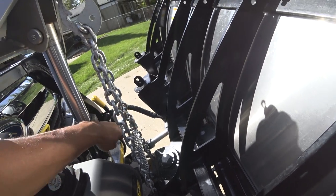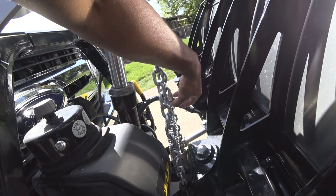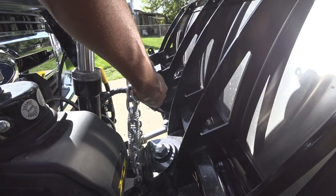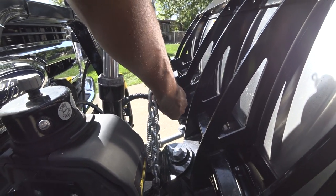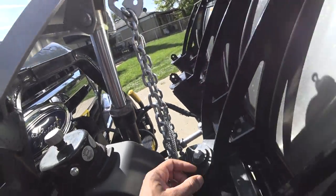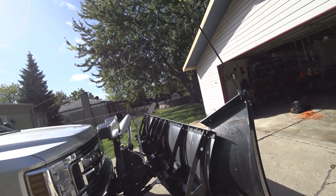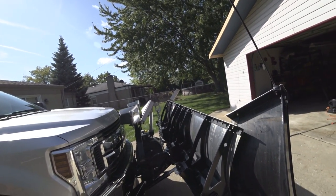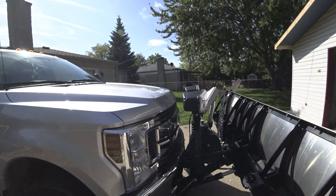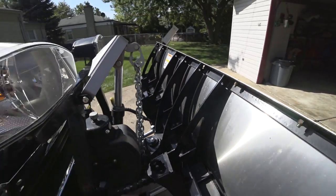This spring return pulls the hydraulic cylinder down, which is interesting. I don't fully understand the reasoning — when you go into full float, it really floats the cylinder all the way down. Maybe that's beneficial for approach angles or if it's a locking cylinder, but it does bring the cylinder all the way down.